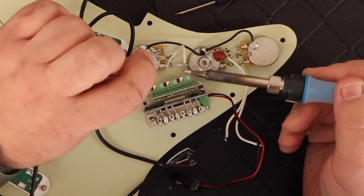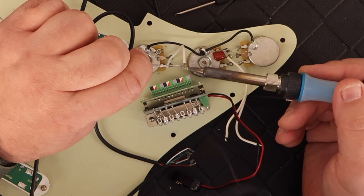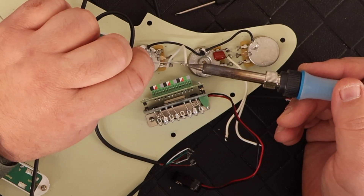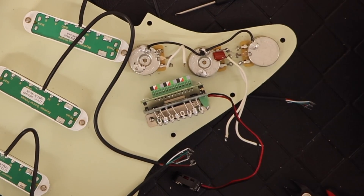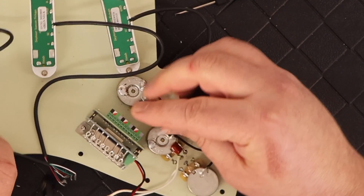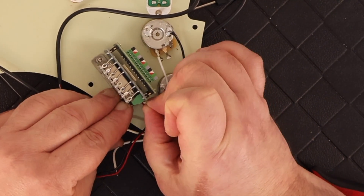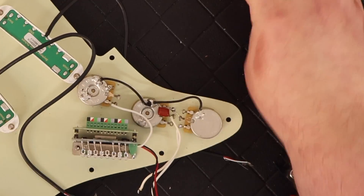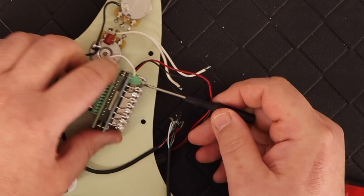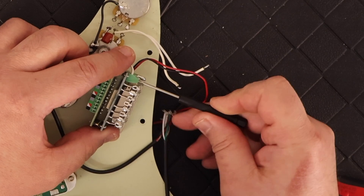This is what I call tinning — you're basically putting a little bit of solder on the end and it makes it almost like a solid conductor. Then once you stick it in the hole, it easily goes in, and you just use the little screwdriver to lock down the wire. Then test it by tugging on it to make sure you've locked it in place, so you don't have to worry about wires falling out of the switch later on.